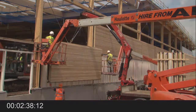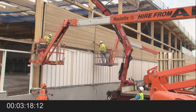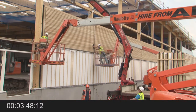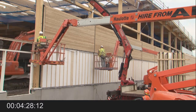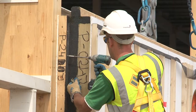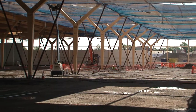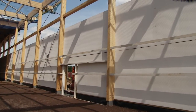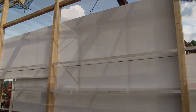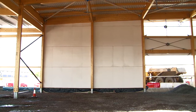The panels can be erected on-site by a three-man team of joiners in conjunction with a crane operative and slinger banksmen. The cassette panels are simply lifted into position and mechanically fixed back to the structural frame of the building. The panel as produced can be left as the internal finish in some situations, or alternatively, battens can be added at the factory to provide a service void, leaving the aesthetic internal lining to be applied on site.